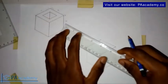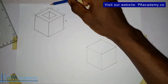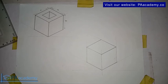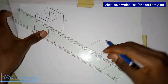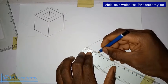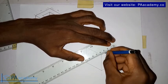Now we already have the cube itself. Let's go ahead to draw the opening. If you look at the drawing, the total length from one side to the other is 40mm, and the distance from the edge to the inner square is 10mm, so from here to here is 10, and from here to here is 10 — placing it at the center. To do that, measure 10mm on this side. This is 10, and then from here to here is another 10; from 3 to 4 represents another 10. We measure it on this side.